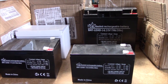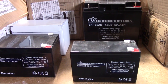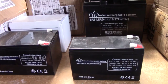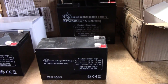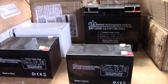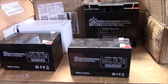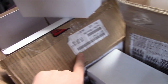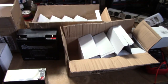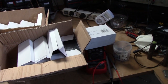The first thing you want to do any time you buy new lead-acid batteries, or especially when bulk buying them, is check the OCV. Because if you get a battery that's got less than about 2.1V per cell, or 12.6V for a 6-cell 12V battery, you could have gotten a battery which has been stored for very long or was improperly manufactured. These boxes are labeled 10/10/2013, so they shouldn't have been stored too long, but I'm going to check every single battery either way — that's why I opened all the boxes, just to have a quick way to probe around.